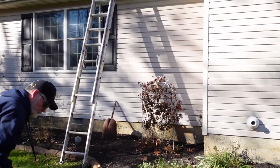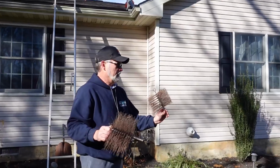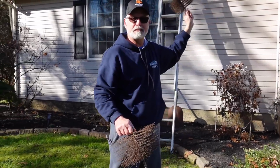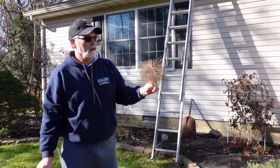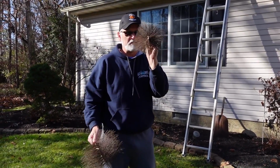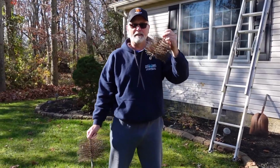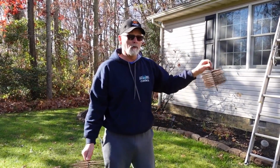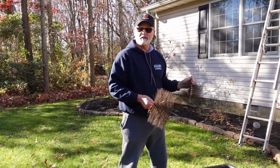Okay, so you're going up on the extension ladder. Yes. And these are the tools that you need to do it. Now, this is for this steel one. This is for the fireplace in the living room. That's a double-line steel pipe, galvanized or whatever it is. So I bought these years ago for that on a closeout sale. So it's not round, but it's the right size. So you just have to take it in and out of the tube a little bit more to get the creosote. And what happens, the creosote then will fall down inside, go into the fireplace because the flue is open. And then you take your vacuum cleaner and then you suck out all the residue.